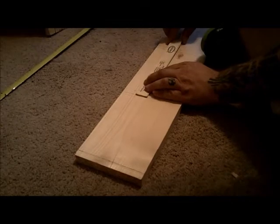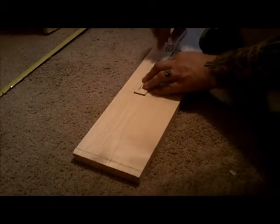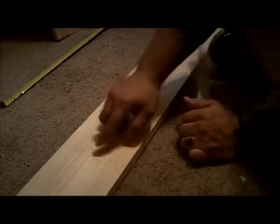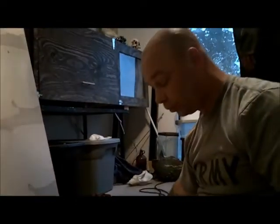Then from there I do the same thing. Mark, tick mark, tick mark, tick mark, tick mark, tick mark. And then I am creating each of my slabs where I'm going to screw into. Here, here, here, here, and it creates enough. Then you count between: 1, 2, 3, 4, 5, 6 tubs can go in, and I got all my lines where my plywood will sit. And then I have about 2 inches at the bottom, which would be the feet of my rack system.